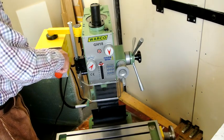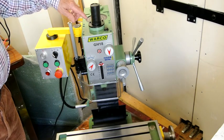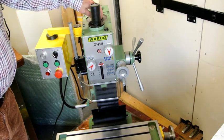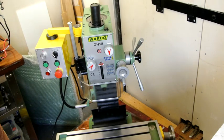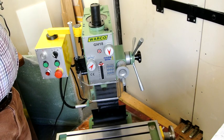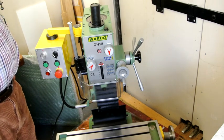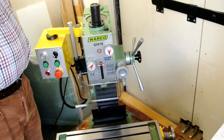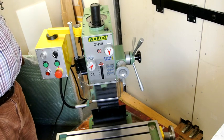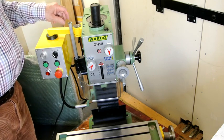This will come off and then eventually when I've stripped it right down I need to get to the quill inside here and the spindle. I'll do away with the gearing that sits inside here and simplify it, reducing a whole lot of weight, because the belt drive motor is very much quieter and will be much more efficient than all the complicated gearing, which makes quite a noise when running. The spindle motor running on a belt drive is much much quieter.